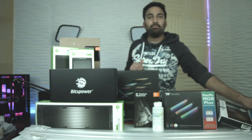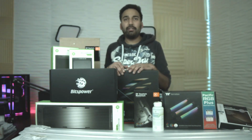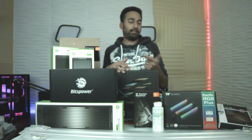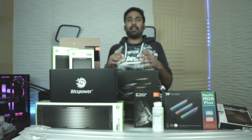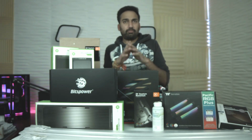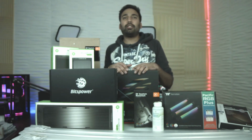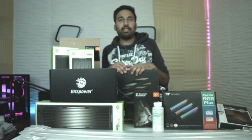We've got our heat gun over here, which should be sufficient to help bend our tubing. I did get a higher value one of those, just because the low value ones were either 300 degrees C or 600 degrees C as their heat options, whereas this one you can set the temperature to whatever you want really, and that way I can make sure I don't either overheat or underheat to get ideal bends. It's going to be our first time doing this, so it's not going to be perfect, but it is a learning process, and I want to show you guys that learning process to see how we get along with it, and see how we get on with all of these different challenges.